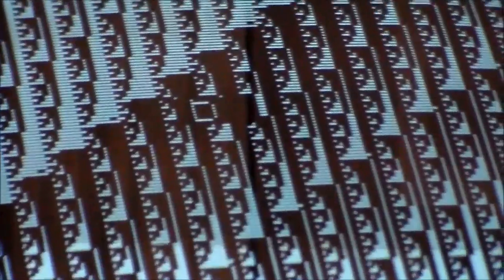We're going to turn it on and see what it does. There it is — it reset. That looks like a D to me. The soundboard is turning off. I believe RAM D is not working, so we're going to check that out. I'll need to take the board out.